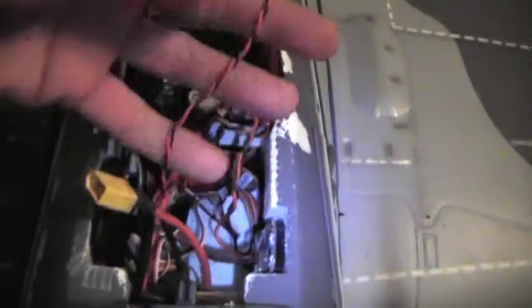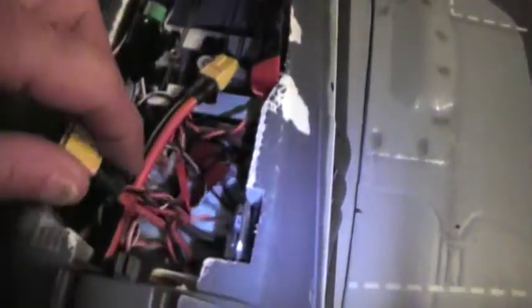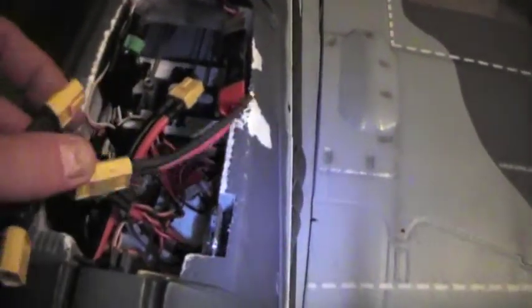There's the BEC — and I do this with all my planes. I take the connector that I'm going to plug the battery into and run two additional red and black leads off of it with JSTs on them, then I can plug in other power devices that I need. In this case it happens to be the external BEC and the voltage regulator that powers the Mr. RC Sound system. It's a lot smaller and easier to tuck away in a tight, confined fuselage like these 1400mm and 800mm FMS birds. I removed the big bulky 14 gauge silicone wire splitter and went right down to servo gauge wire — still plenty perfect, and I have no voltage problems whatsoever powering the system.